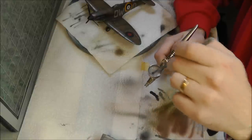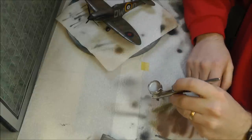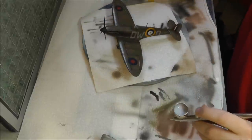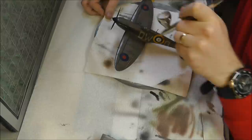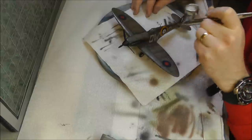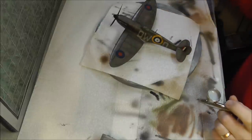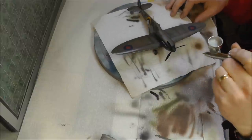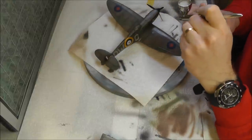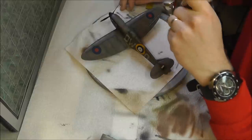That's looking good now — give it a little bit more to make sure, and that's looking good. Let's do a little bit of spraying and make sure the flow is good. We don't need such a high air pressure because we've thinned it down. We're just going to spray this on as a nice matte coat, putting on a nice light first coat — a nice misty coat — and then we can come in with a proper coat after, which helps everything stick better.